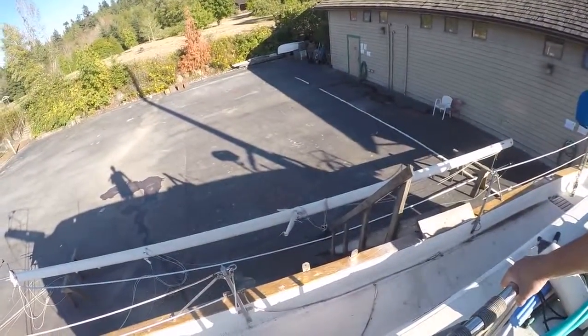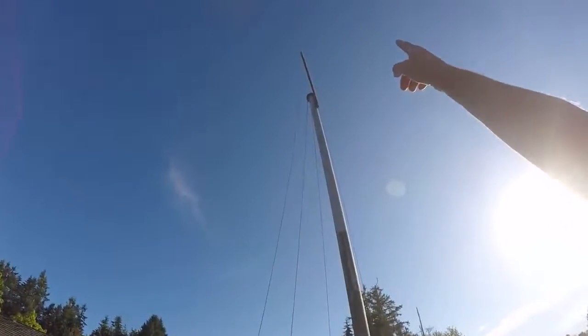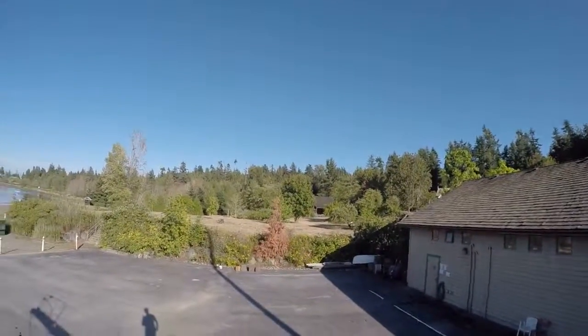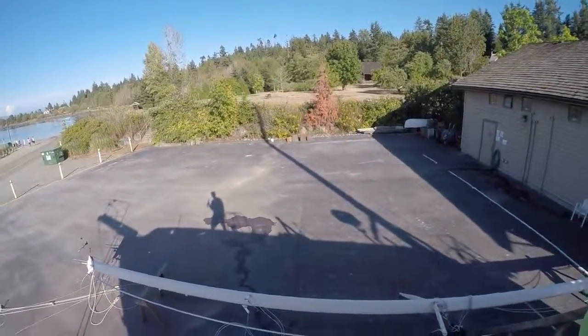We did have a wee bit of a mishap. We were using the mast crane to put it over the side, and I thought I had gotten the center balance on the mast — just about the rope wrapped around the spreaders and a little bit below — but I miscalculated. The bulk of the weight of the mast is actually above the spreaders, so once I released the base of the mast from the tabernacle, the crane had enough weight on it that it just swung. Right at the top of that arm there it's hinged, and once the weight of the mast was on it, it just swung over and away it went. The mast went outboard and I thought I was going to go over, but I ducked. Rather than wrestle the thing and be a hero, I just let it go.